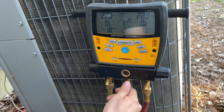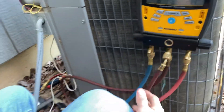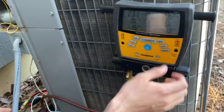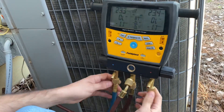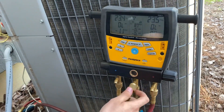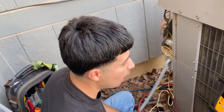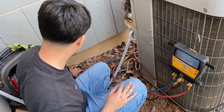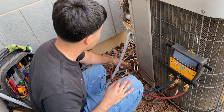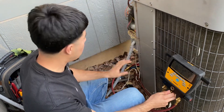You can grab a recovery machine and recover the rest, which is pretty much just vapor left in these lines. Both of these lines — it's just vapor. A lot of guys will just open this line and let whatever's in the lines out, which is pretty much just vapor, but you don't want to do that. You want to recover the rest of whatever's in the lines. Once you do that, you'll have zero PSI — pretty much nothing left in your lines. Then after that you can cut your lines. There should be no more pressure, so you've got most of the liquid refrigerant out into your condenser.